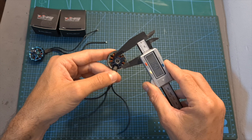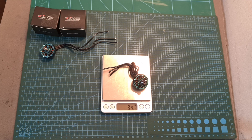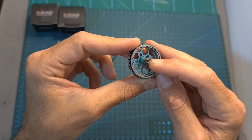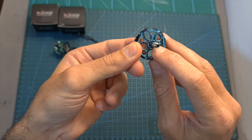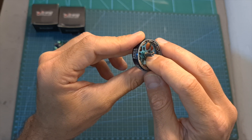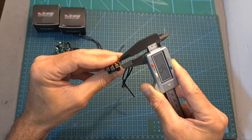In terms of specs, this motor features a 16 by 16 millimeter mounting pattern. It weighs 34.7 grams, including the full length of the 15 centimeter long 18 gauge silicone coated wires. The motor shaft is secured using a hex screw. Inside the motor bell there are 14 magnets, and the motor shaft is hollow. On the top side of the motor bell there is a grip pattern for better securing the propellers, and inside on the top of the motor shaft you can find a rubber o-ring to help reduce vibrations. The stator diameter is 26 millimeters and its height is 4.5 millimeters.